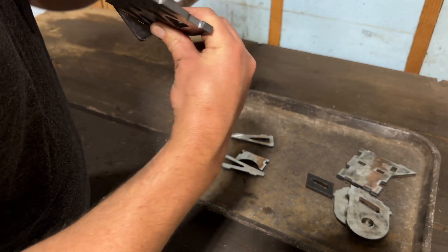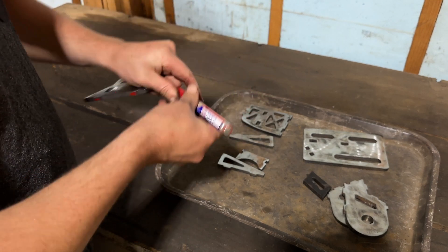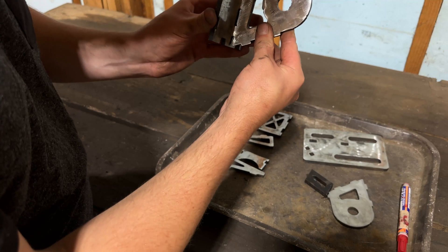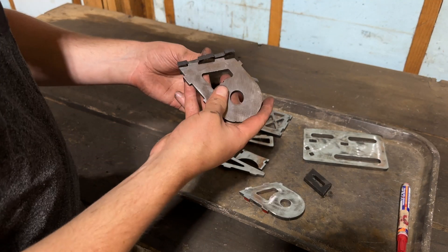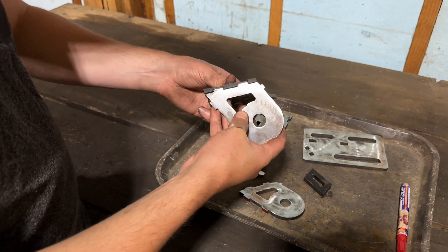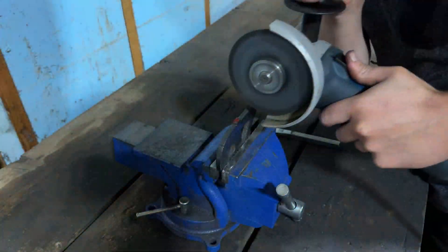I've been really liking this tab and groove design to be able to have the parts click together so easily, although I'm still trying to deal with a lot of the tolerancing for the CNC plasma table to have them click in smooth and seamlessly from the get-go. There are definitely a few things I've thought of while doing this that I'm going to try for the next batch, but for now I'm just going to clean them up and make it so they click together properly.